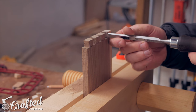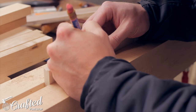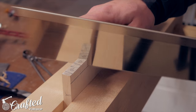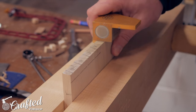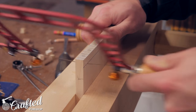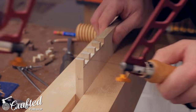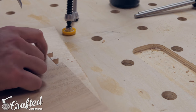I cleaned up any areas that didn't get chiseled out, then traced the tails onto the adjoining side using a marking knife. I traced the lines with a pencil to make them more visible and used the marking gauge to establish a baseline. On this round of cuts I used the opposite side of the dovetail guide, which allowed me to match the angles of the tails on the pin board. Once again I made my cuts, flipped the board, then made the cuts from the other angle, and removed the majority of the waste with the fret saw. The sides of the waste area are angled, so make sure not to cut into your pins. I chiseled away the waste to my baseline — a little trickier because of the angled sides — and eventually got it cleaned up.